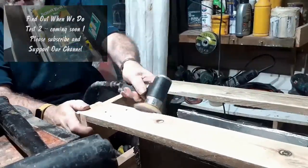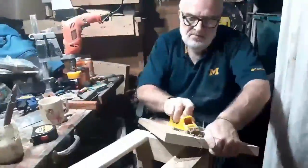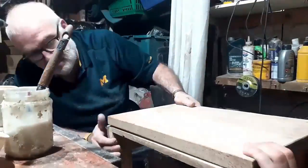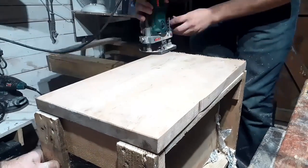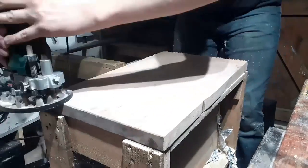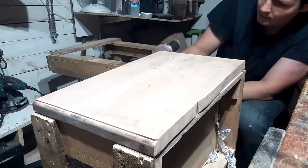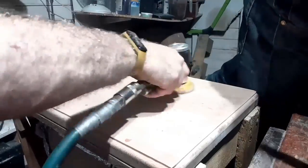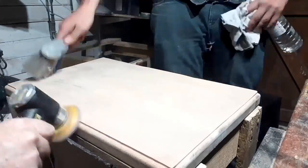So they calculated the cubic space of the camper and calculated the cubic feet per minute of air they required for a constant airflow within the confines of the camper. What does the cubic feet per minute mean, you may ask? CFM stands for cubic feet per minute. It is a unit of measurement used to quantify the volume flow rate of a substance, typically air, through a specific point in a system. CFM is commonly used in applications related to ventilation, heating, and cooling, where it helps determine the airflow capacity of fans, air conditioning units, and other equipment. The CFM value indicates how many cubic feet of air can pass through a particular area in 1 minute.